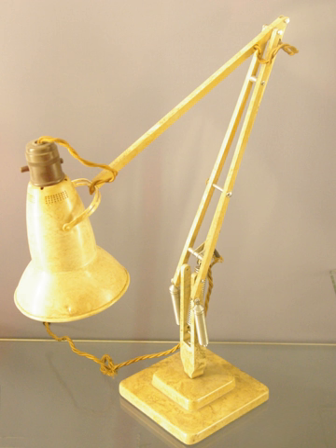Here are some less common ways of balancing arms. Lamps having a vertical axis: this kind of lamp has a forearm balanced by weight or springs. Its disadvantage is that the upper arm cannot point up or forwards. Friction: the friction between the twisted arm controls the movement between the arms.